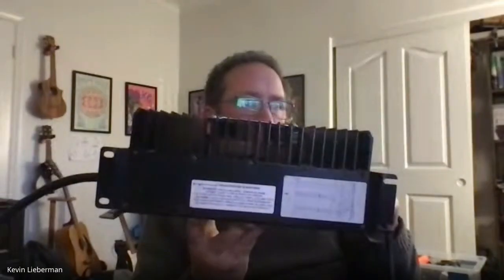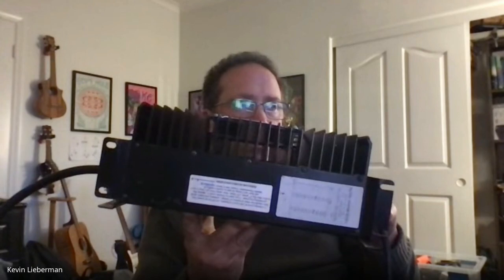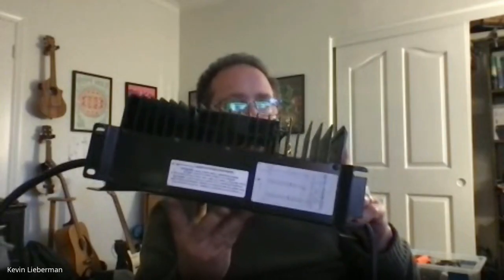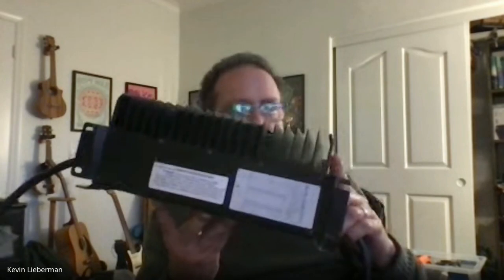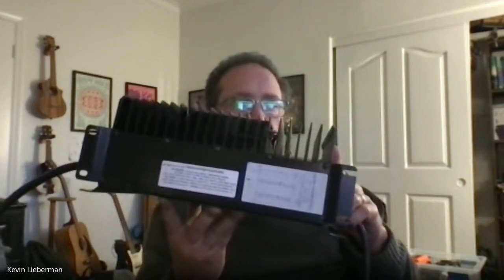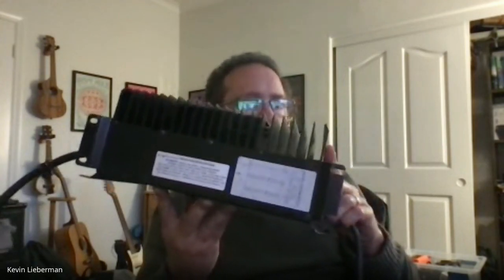This is an Elcon, but it's a 3,000 watt, 3 kilowatt charger. They make bigger ones. I saw something in the text about this. You need to get a bunch of matched ones, but these are basically disposable these days because people don't know how to reprogram them, but we know how to reprogram them for almost any voltage that you want. So you find a bunch of these, we've got the secret sauce to reprogram them. All right, oh yeah, nice.